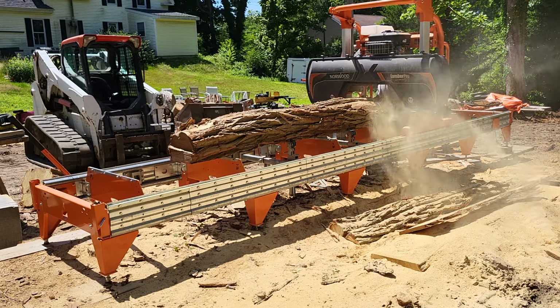So what I'm doing right now is I'm setting my eight quarter scale, which is the green scale over here, where I am at 9 1/8. That means I'm scaled off the top. If I set this off the bottom, let's say I set it at 2 so that one of these lines would line up with 2, that would be scaled off the bottom. Right now I'm scaled off the top because I have a nice, clean, thick, wide cut all the way down. So I'm going to drop on 2 inches.